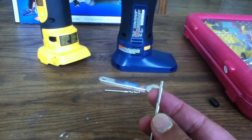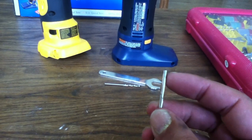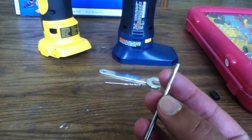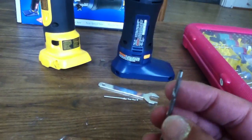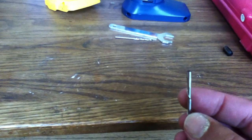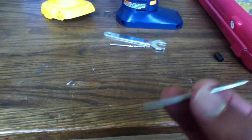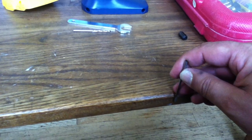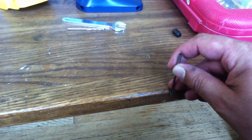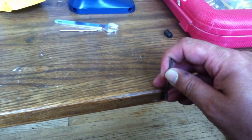Usually you're going to see two types of blades on these things, and usually they're going to be included with the tool. But this is a wear item — they heat up very quickly and they wear out. You'll notice that the cutting part is very similar to a drill bit, but it's actually a spiral saw blade. The cutting part doesn't extend to the tip. The reason for that is, with some careful adjustment in how you put it in, you can use it for edge-cutting linoleum. The non-cutting part traces along the edge of the plywood while the spiral part cuts the linoleum. On fancier bits, you'll have a little ball-bearing type arrangement in there.